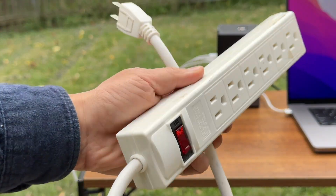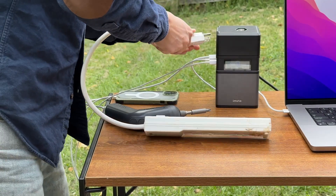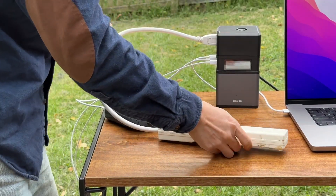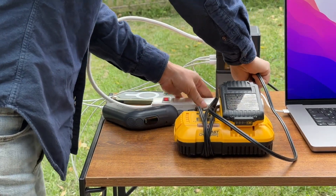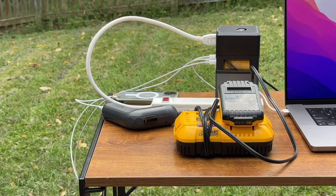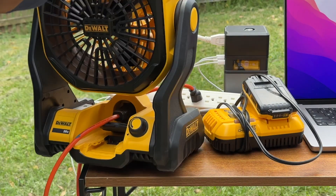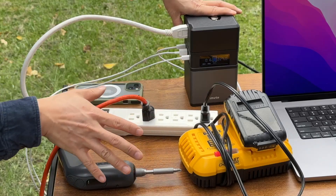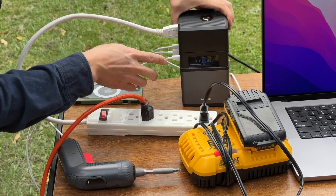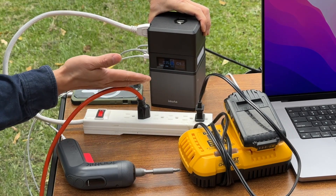You can seal the top and have a very compact setup if you don't need the AC module. There's nothing preventing me from adding a little power strip as long as I keep the total power consumption under 200 watts. In this case I'm adding a fast charger and a little fan. Now it's charging and my fan is on, but the whole power got cut off because it exceeded 228 watts.